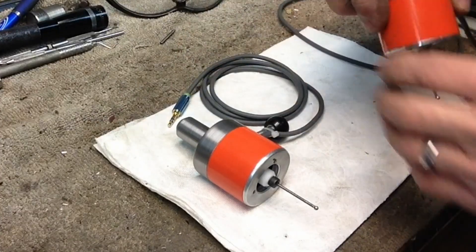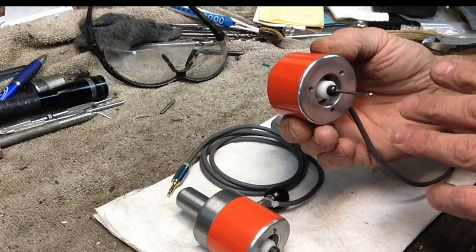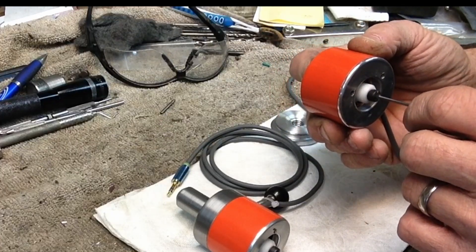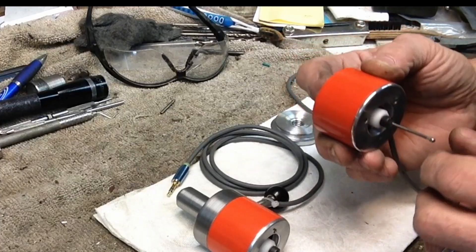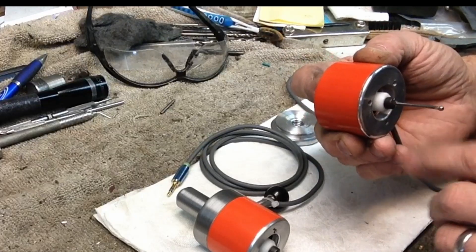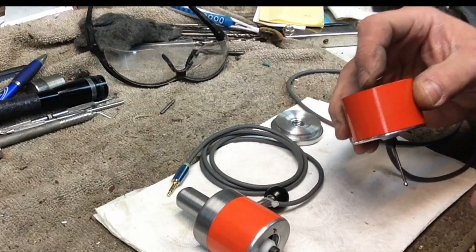The spring that goes in between — we'll show you on this one. When I tried to level it with the three adjustment screws on the bottom, it wouldn't adjust. It was too sensitive and didn't want to hold position. With that little spring tension it wasn't moving the probe back to center. I ended up breaking loose the silicone that retained it twice, going back and re-gluing the first circuit board until I figured out what the problem was.